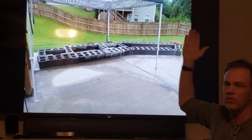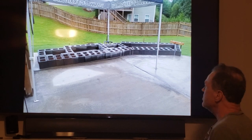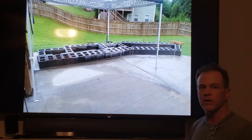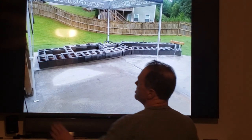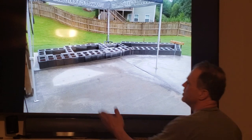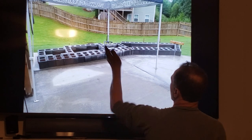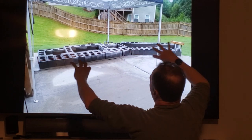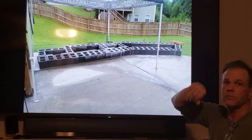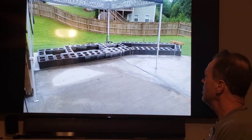Luckily, I left huge gaps under my foundation of excess just by luck. I didn't do that by skill. I just thought, you know what, if I need to wiggle it before I start. So it was just blind luck. I had 6 inches to work with on either end of my project because 3/8 of an inch of mortar has to go between every single one of these blocks, which spreads the whole project out. Huge mistake. Please plan for that.